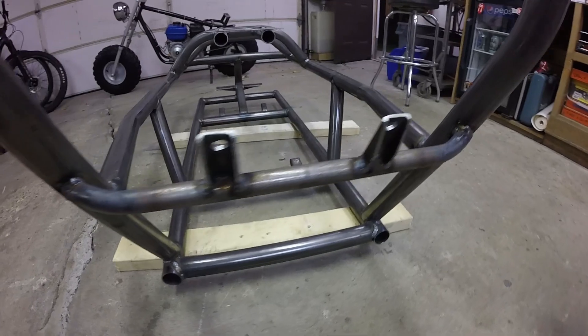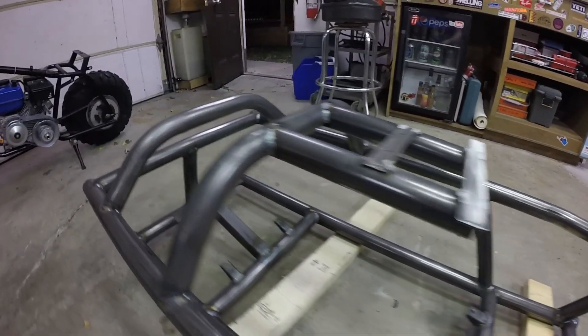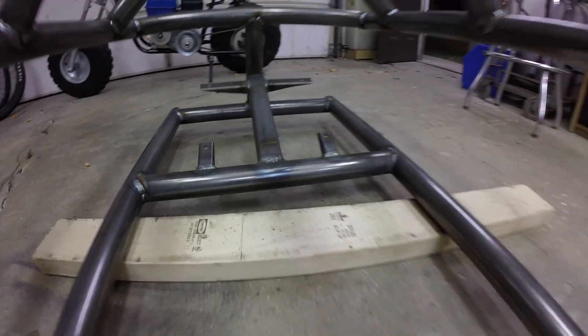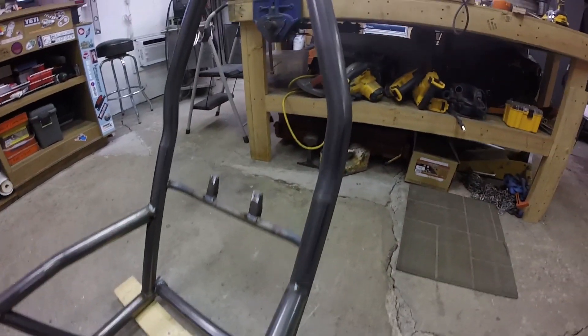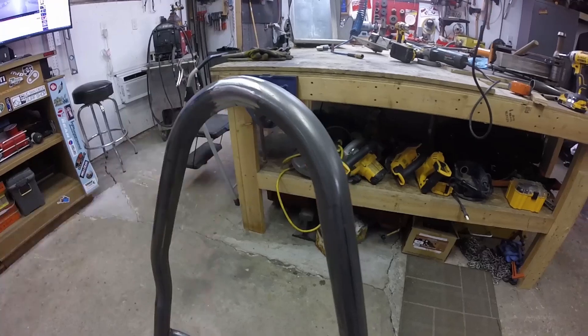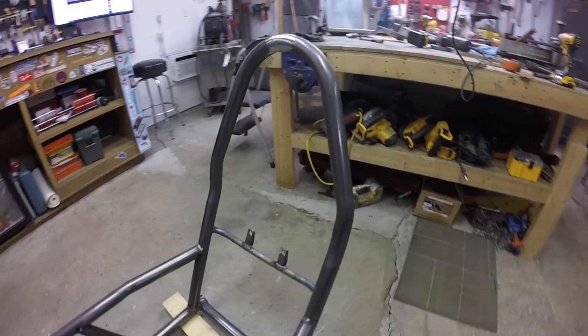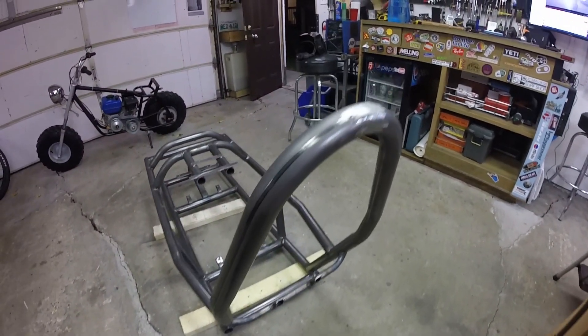You can see some of the brackets I did for the seat, brackets for the wheel, and pedal mounts. One compromise I did have to make is I had to cut and weld the bar over your head, because my bender doesn't do that tight of a bend — so it's two pipes welded together, which I still have to do some sanding on to get it smooth.